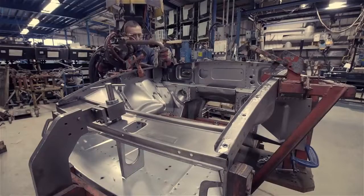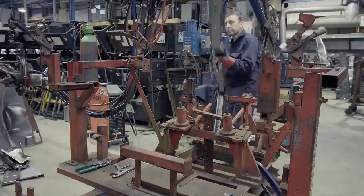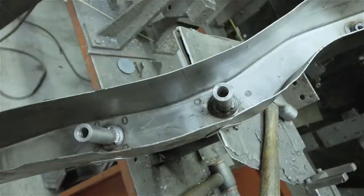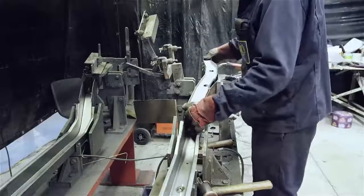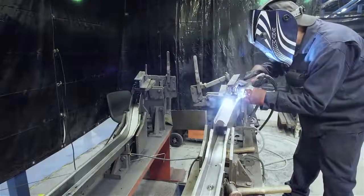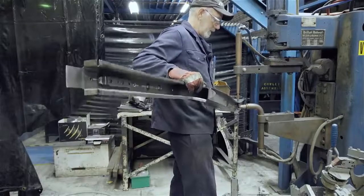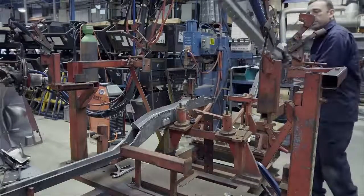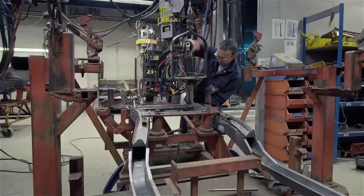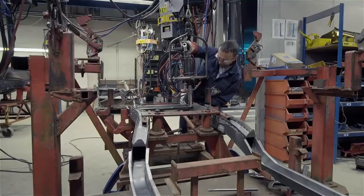Starting at the beginning, we'll first look at how the front section comes together as one of the main sub-assemblies. These front chassis rails are designed to carry the weight and stresses of both the engine and the front suspension. Strong support tubes are MIG welded inside the rails — this is where the front suspension cross member will be attached in the finished vehicle. The top plate is placed into position and MIG welded round the support tubes, then welded to the main rail using the big floor-standing vertical spot welder. The operator works around the assembly using a hanging gun — the term hanging refers to the way the heavy spot weld gun is supported and counterbalanced from above to make it manoeuvrable.